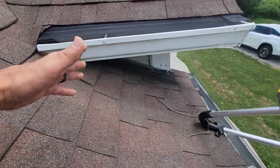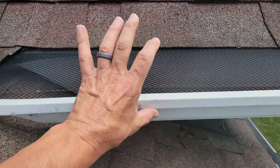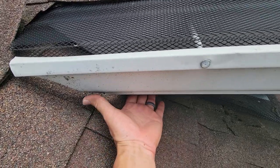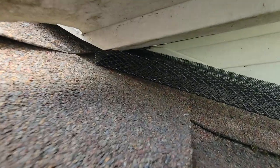It's probably even worse in the framing below because of this. What we typically see going on when you have a section coming up is there's an area where this fascia board behind the gutter comes into the roof deck. Usually it's buried in so tight they notch a shingle like an L-shape to go up around it and they don't flash that, or they shove it up under all the way like it is here.